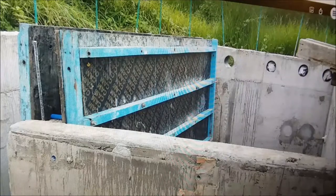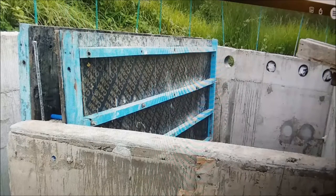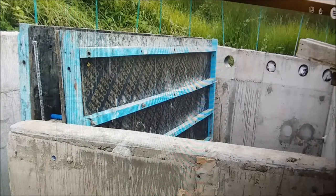Now we're inside the septic tank. The round holes on the back wall are air intakes — they come down over the primary digester. That little round-topped wall you see is seven and a half feet from the floor. It's a deep septic tank with a lot of air space on top — about 20 inches of air space currently.